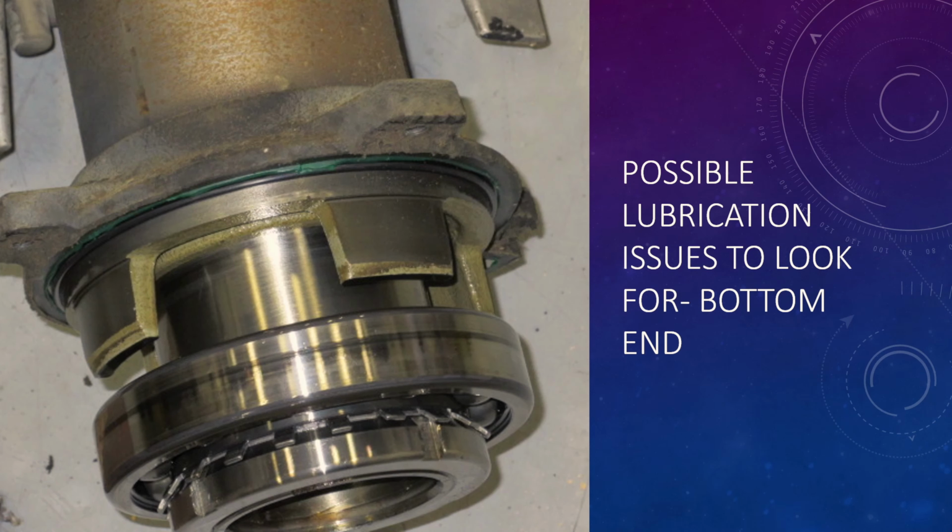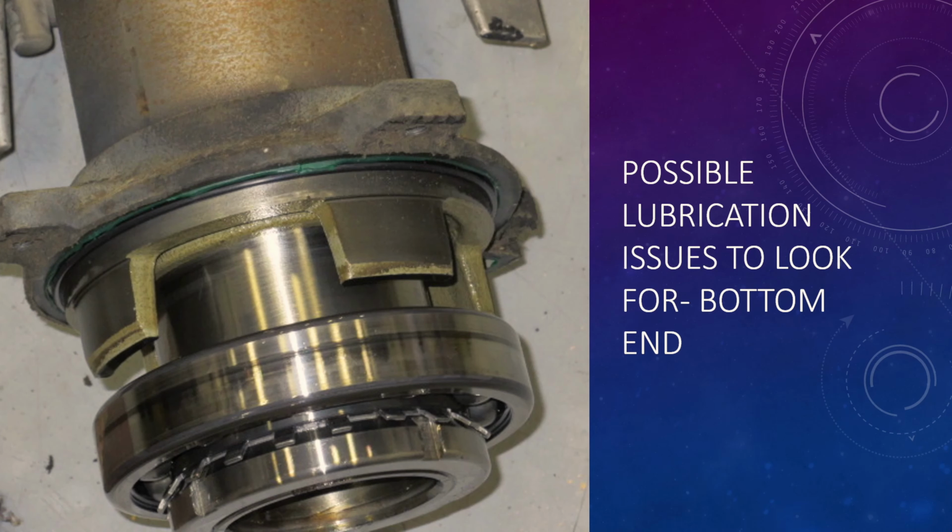The reason for that is that when you're setting the end play, let's say there's a 10 thousandths difference in the fingers, the bearing is going to cock. You're going to have one finger long and short over here. So what happens is you're taking the internal clearance in a bearing and you're going to cock it inside there. And we found a lot of them. I mean, it's surprising when you start looking for them what you see.